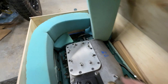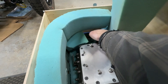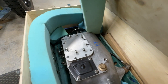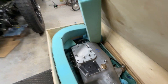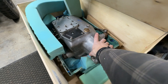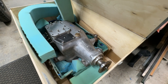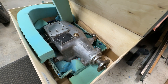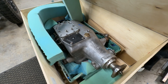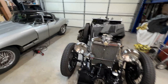Unlike a regular clutch-driven car, this car doesn't have a main pressure plate up front against the flywheel — it's a straight shot from the crank to here, so all the clutching is done for each gear. The reason that race car drivers liked that so much is they didn't have to double clutch for smooth gear changes. These pre-selector boxes were really nice because you could pre-select the gear, and then four miles later when you hit that curve, you just press and release the gear change pedal, keep your hands on the wheel, and it'll go into the next gear. They're wonderful to drive and really well suited for an old MG race car. This car is not going to build itself, so we better get to work.